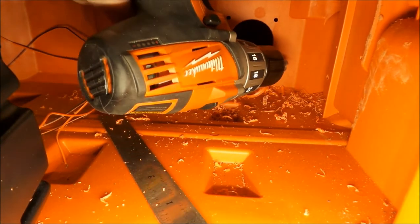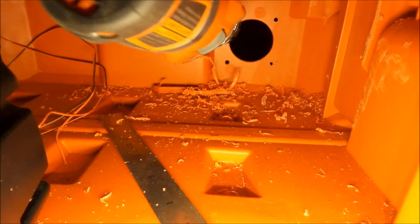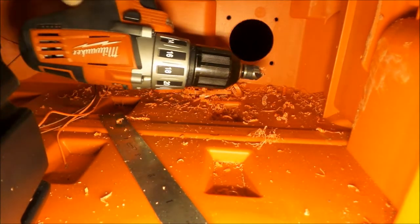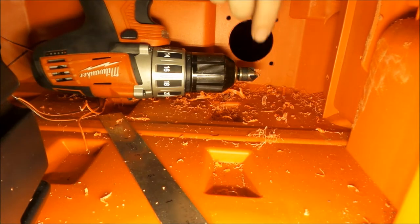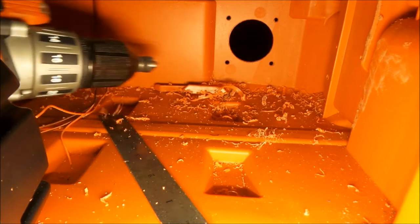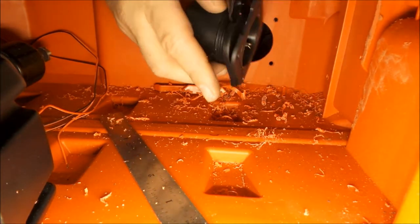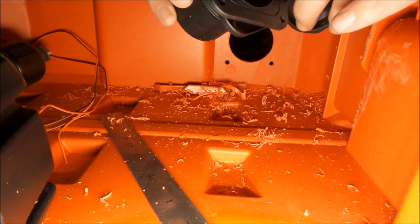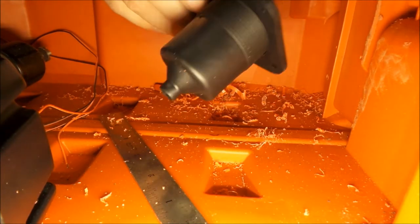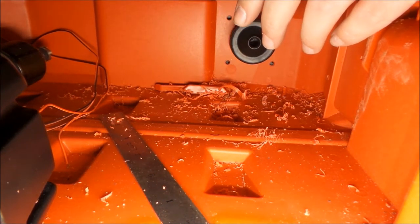One of the reasons why you end up with so many tools, here's an old 3/8 M12 drill, is you end up putting many different tips on all these tools. So here we put a basically countersink on this, and we're going to use that to get our just a deburr. And here we have our plug inlet. I'm going to orient it so that the ground is up when the box is standing on end. That way, when it's sitting the way it is now, the neutral will be up, and if something falls in there, it's just a safer practice. So here we go, just like that.